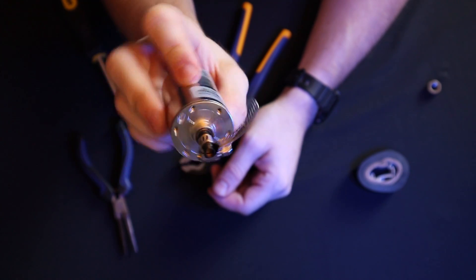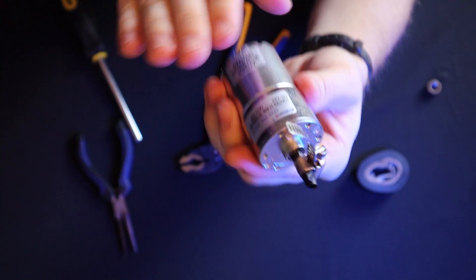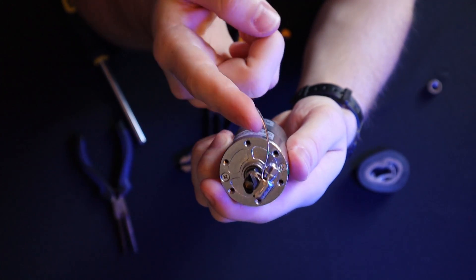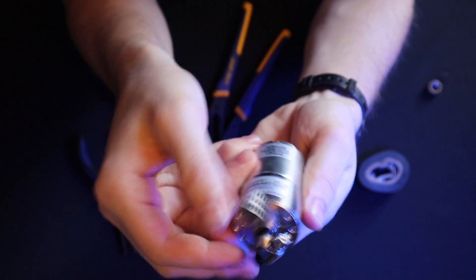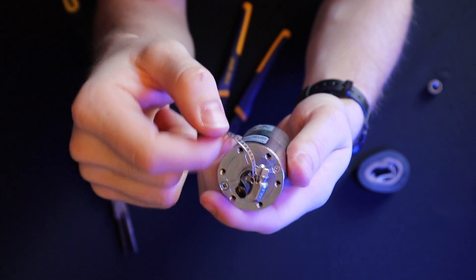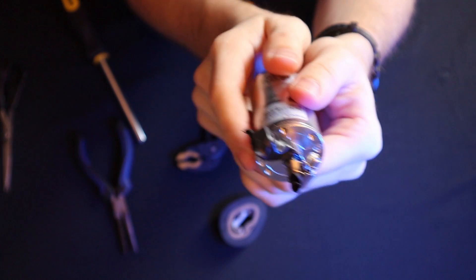A little bit of the method behind this madness. I want to make this motor spin — this is going to be what's tapping on the bottom of my desk, so it's going to be mounted here. And then this — see how it's over? I can put a weight on this so when it spins around, it'll knock. It has enough spring in it that it'll allow it to go around, and I can bend it to however much I need. So as this spins around, the weight on the end will knock on the bottom of my desk.